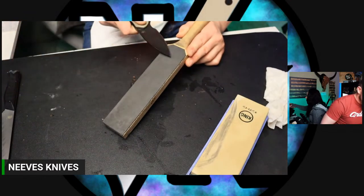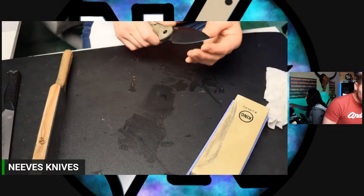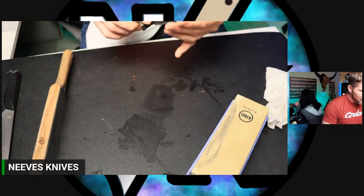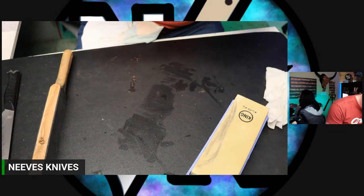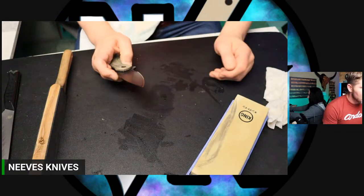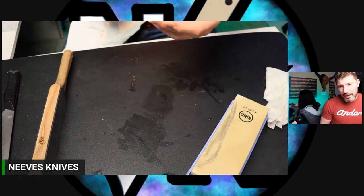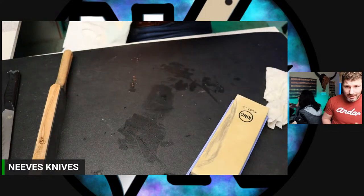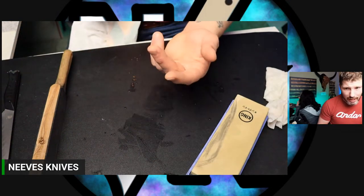The higher the number, the more coarse it's going to be. So for micron wise, not grit. If it's going to be six micron, that's going to be finer and more of a polishing than nine micron. But nine micron is still a shiny edge. So if you're coming off of a stone that's say 5,000 grit, you don't want to use anything higher than like six micron. But six micron will be really good for edge maintenance and for coming off your stone and knocking burrs off.